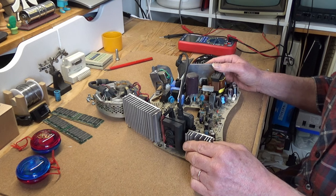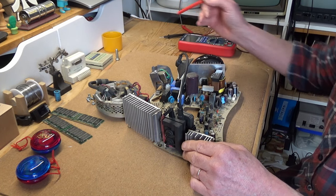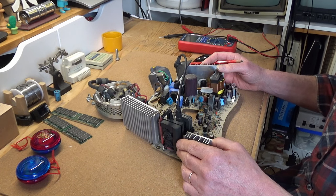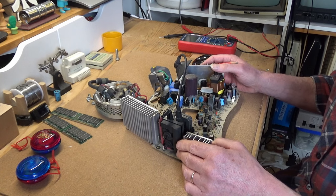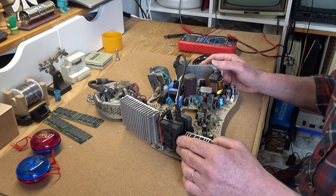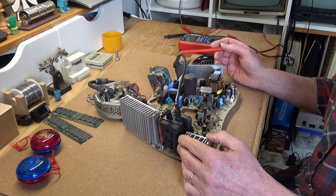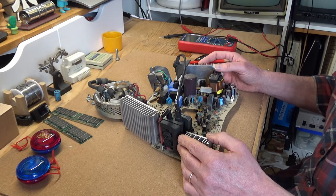If nothing else is broken, that could very well be the culprit, and that would spell the end for the repair of this G3. Without owning an LOPT tester, which is a meter-like device which essentially injects an oscillating signal into the flyback and measures the echo, known as ringing, there are very few meaningful checks that can be made to determine whether the flyback is good or bad.